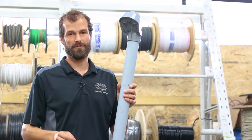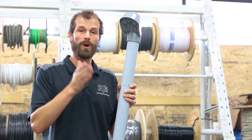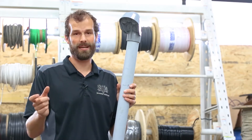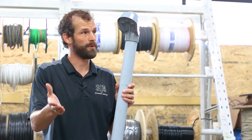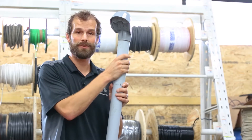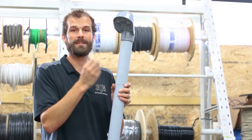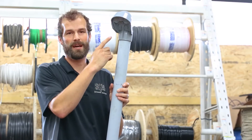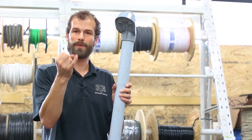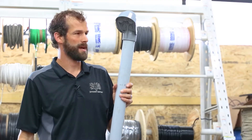The utility overhead drop is exposed to free air, meaning the wiring can dissipate heat and is therefore acceptable at a smaller size. Wiring contained within conduit is concealed and protected — a plus — but it's inhibited from dissipating heat. So you'll notice the wiring exiting the weather head might be as big around as your thumb, whereas the utility wiring might be smaller than your pinky. That's the reasoning behind those differences.